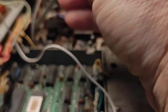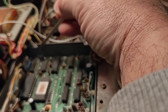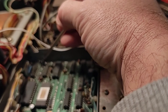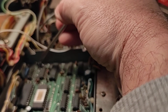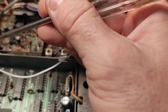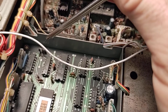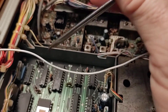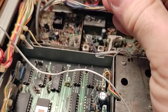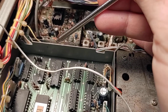That's the CTCSS port wire — I'll explain that in a minute. There are three jumpers located right here. See these three jumpers at the back of the board. Now they're set to what I guess would be U.S. spec, which is 144 through 148. This, I think, will do 141 through 149 but don't quote me on that.